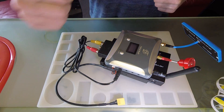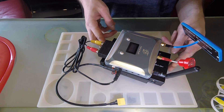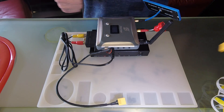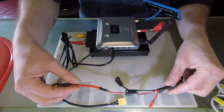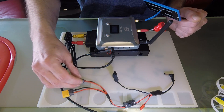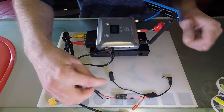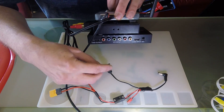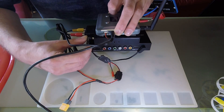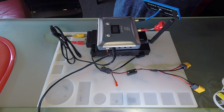The other cable I need is a power cable to supply 5 volts to both boxes. I made a special cable because I had interference problems between the recorder and the receiver. This cable has an XT60 input, an XT60 output for other devices like a charger, and a step-down module to 5 volts with two connectors for both boxes. However, I cannot use the same power line as the receiver — if I do, I get problems on the picture — so I have to use two dedicated batteries.